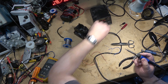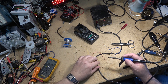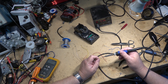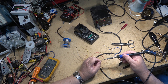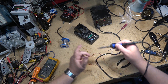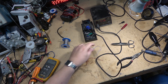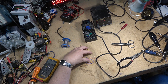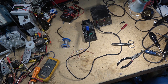This was a cheap soldering station but it's been a really good one. I've had it three or four years — it's a knockoff of a Hakko, called a Zaxion or Yaxun. It's worked quite well over the years. It can melt solder and the tip is calibrated so it's fairly accurate. So if you've got one of these things acting up, just cut off a piece of the wire — it's usually going to break right at that high-stress point. Shorten the leads a bit and you're back in business — no need to buy a new handle for a broken cord. Thanks for watching.